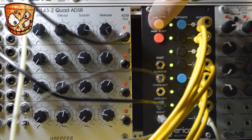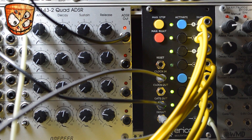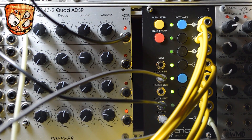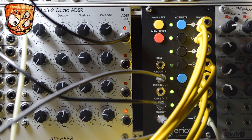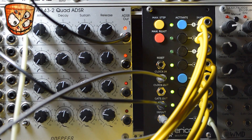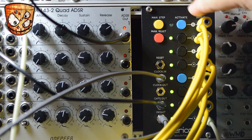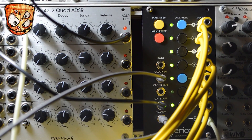So now I'll add a clock to the switch. We can skip steps by pressing each button once. What this does is go through the step but it cuts out the signal and the gate that's generated from that. Pressing the button again brings the step back on. To actually cut a step out completely and fully skip it, we just double press the button which creates a shorter loop. Pressing that again brings the step back on. Holding on a step and then pressing the step below merges those steps to create a new rhythm, and this affects the gate output as well.